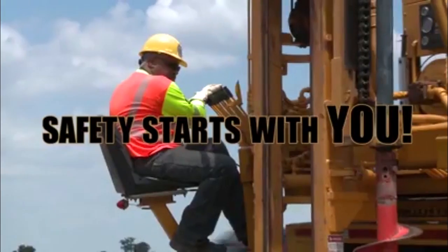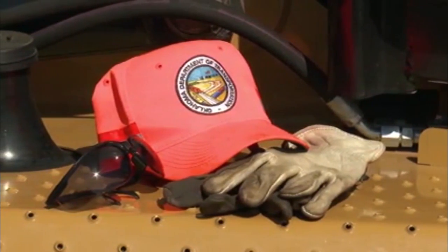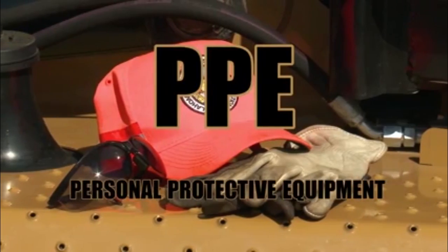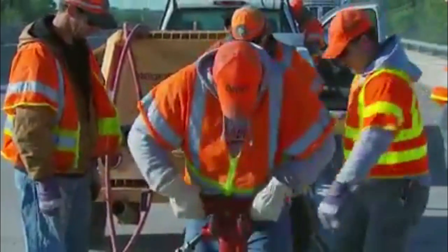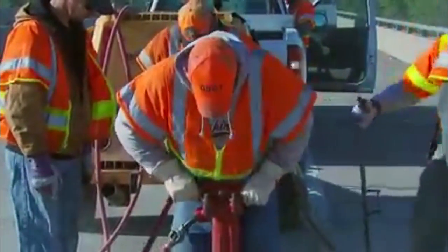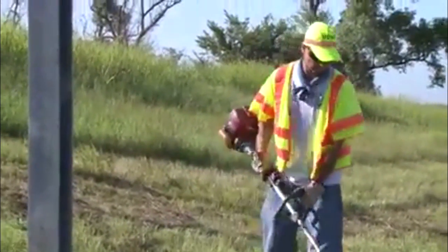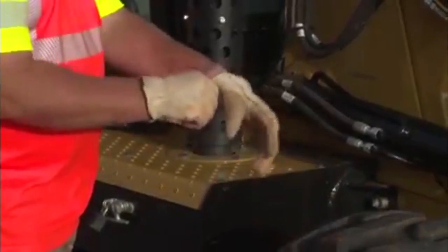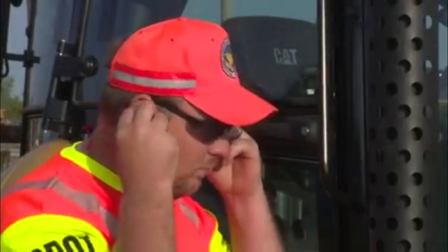Safety starts with you. A good way to practice safe work procedures is by using the required PPE, or personal protective equipment. This consists of, but is not limited to, an ODOT approved ANSI certified Class 3 safety vest with sleeves, a highly reflective hat that is bright and clean, and a pair of sturdy gloves. Keep in mind that gloves reduce the sensitivity of your hands, which may affect your ability to operate some backhoe controls. You may also need to wear eye and hearing protection if the job calls for them.